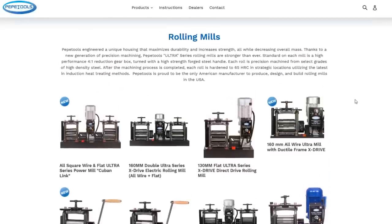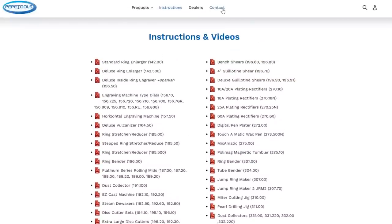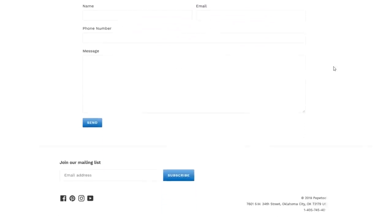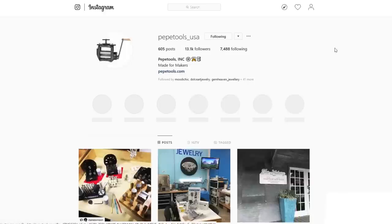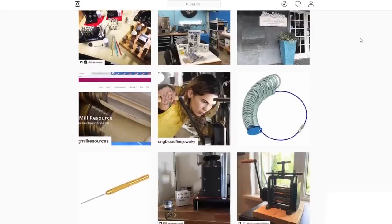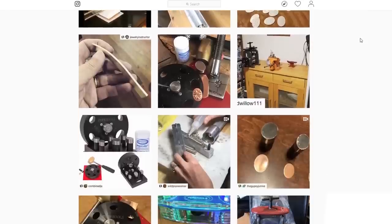Remember to protect your rollers from moisture. Even a little bit can cause them to rust, so dry your metal carefully each time after pickling before you work with the rolling mill. And it's best to use dried plants, as you can see in the video. I did try once with the fresh ones, but the effect was far from what I expected. They were completely squished and gooey, and no print was left on the metal, so definitely something dry.